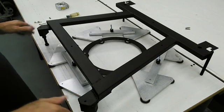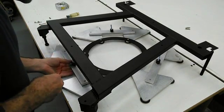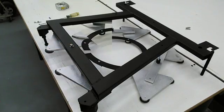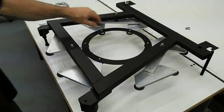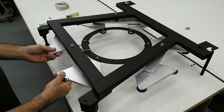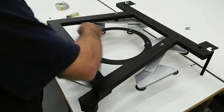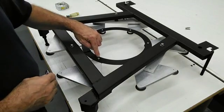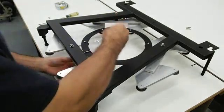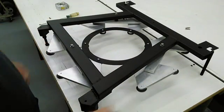I have the inner cell frame here. I'm going to mount the crossbars and triangles to it — the bolts will just come all the way through the ring and get nutted on the back. Now, I got all the triangles mounted up. The ring is free from the triangles, but the triangles could also rotate with the ring being completely free, and we don't want that. We want to make sure that our cell points stay in the proper place. So one of these screws has a nut on it — after I center out all the points, I'll tighten this nut, which locks this triangle from being able to move on the ring, keeping all of them in place.